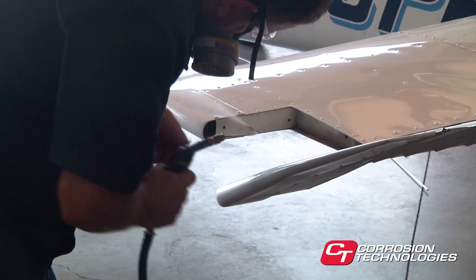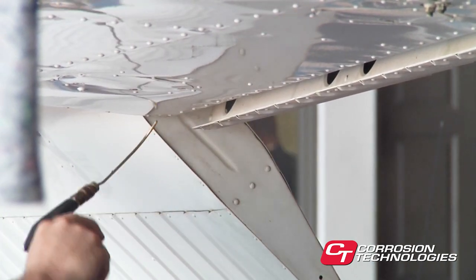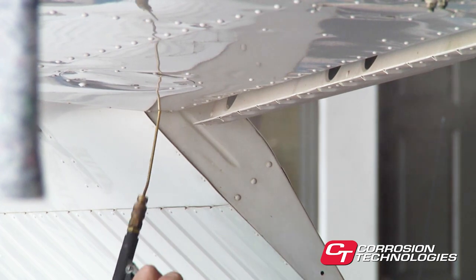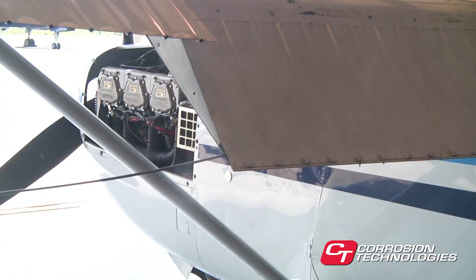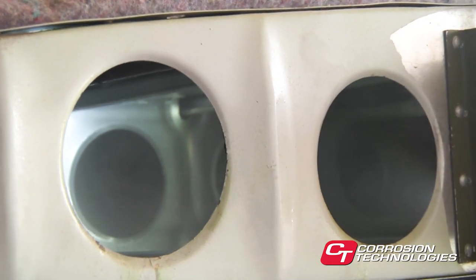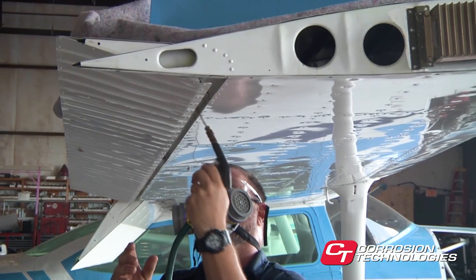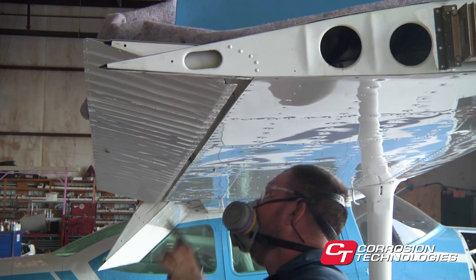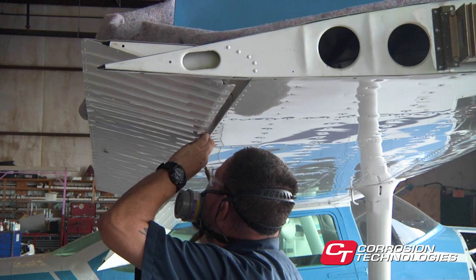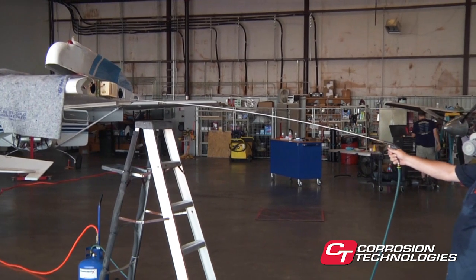Your experience and familiarity with a particular aircraft being treated will determine the best approach. Remember, when treating any aircraft, vehicle, equipment, or parts, your objective is to leave a haze of product on all interior surfaces. Visual inspection should reveal uniform, wet-looking surfaces without excessive dripping. Expect some dripping after proper treatment and be prepared to simply wipe off any excess CorrosionX that leaks out. One last thing to keep in mind is that paint won't adhere to surfaces treated with CorrosionX. Either do it before the CorrosionX treatment or wait at least a year after treatment before painting.